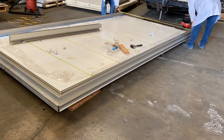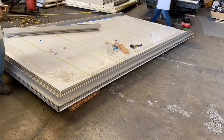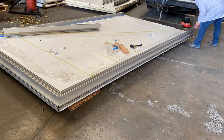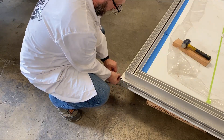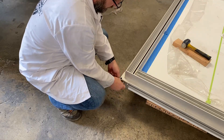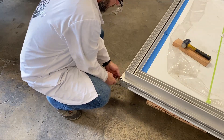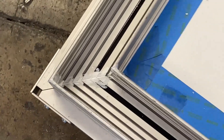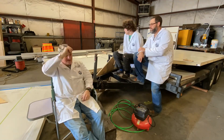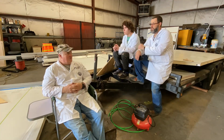Measure the fitness of the extrusions on the floor panel for square by measuring diagonally corner to corner and adjust as necessary. When the extrusions are square with the floor panel, reinstall the corner brackets to hold everything in place. Wipe any excess glue from the extrusion ends and the front corner miter joints. Take a two to five hour break to allow the extrusions to set into place.